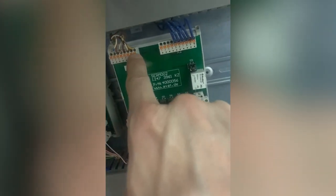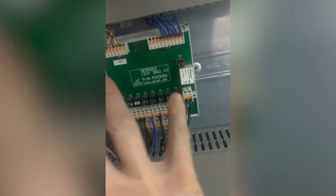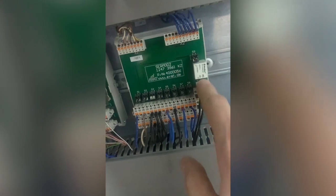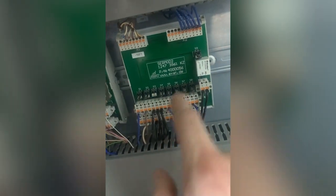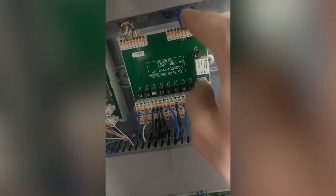This one here I've got to find out, but then 1, 2, 3, 4, 5, 7, 8, there you go. They signal back to the PLC which one of these isn't working, but I'm losing the entire lot, I'm just losing the safety chain. So I know that these aren't coming up on my PLC when I have a fault, but this is failing, so I think these individual ones are working and signalling to these, but I'm just losing it somewhere on this side of this relay.